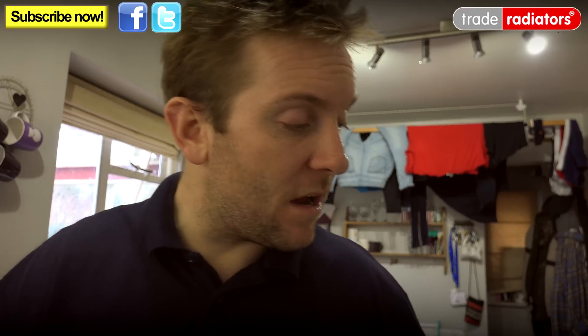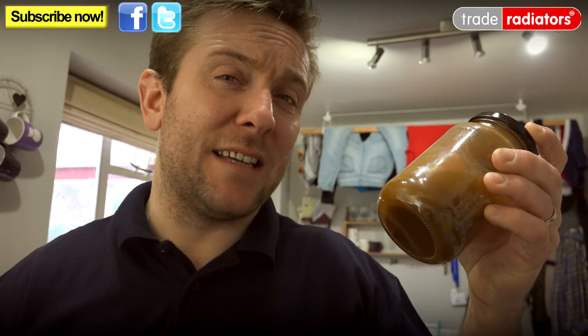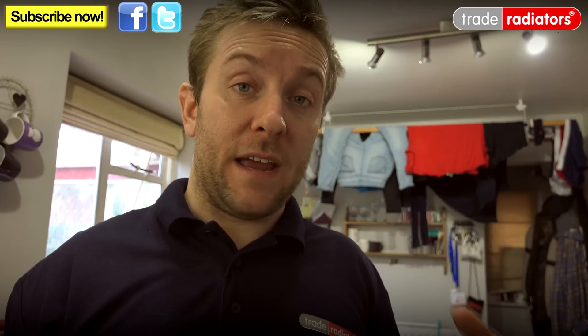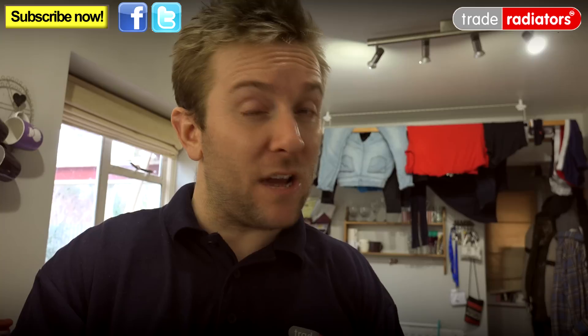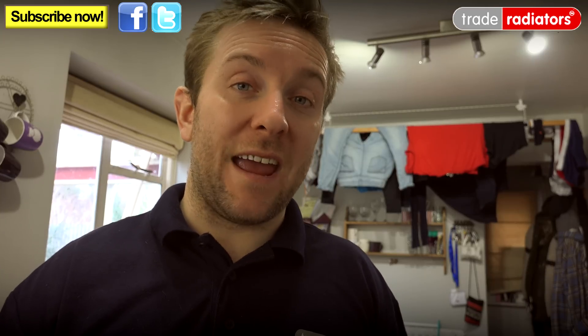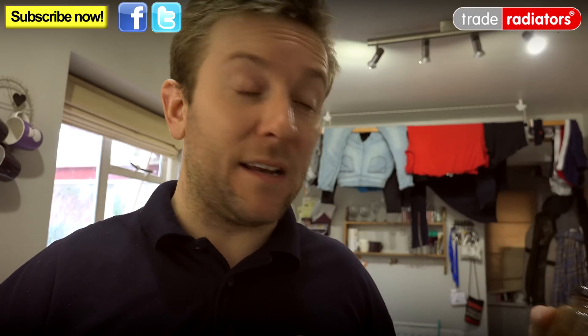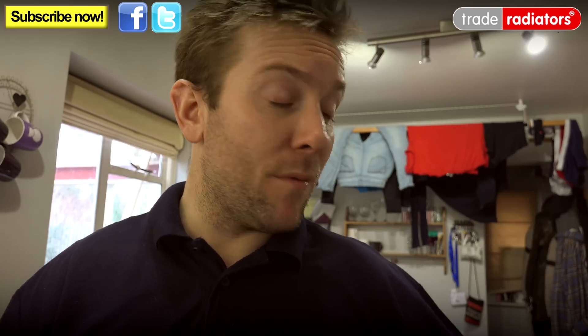Also, this stuff that you see here is kind of magnetic because it's the rust particles of a metal nail. And therefore, sometimes it's a very good idea to have a magnetic filter on the return side to the boiler to protect the boiler. It will also remove a lot of this. When the boiler gets serviced or you do anything to the system, you go to your magnetic filter to get that removed.